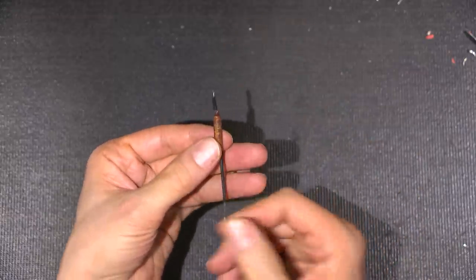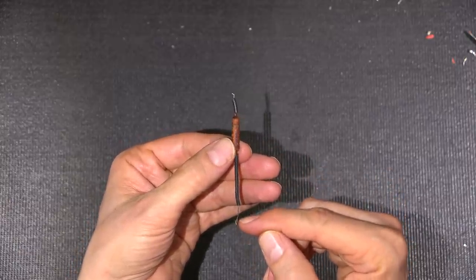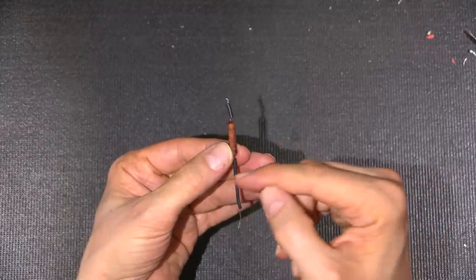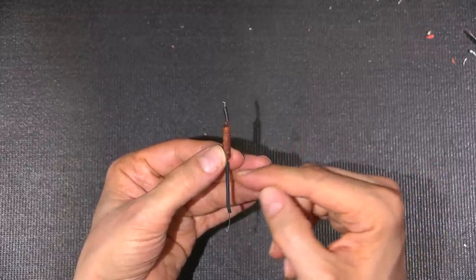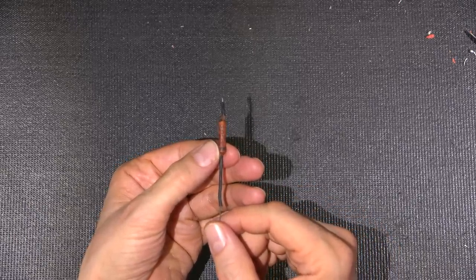And as you can see, they're already thinking that way. This is the lower impedance portion of the circuit, so it's okay to have a little bit longer lead on this end. If you have no choice, this is the end of the capacitor that you would have the longer lead on because it is the outside foil end.